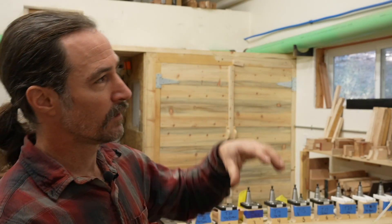It's a lot quieter in my shop now. Even if I get a cyclone dust collector in the future, I'll probably still use a closet because it will just make it quieter. For the test of whether it's actually reducing more dust, I won't know for a while — I need to use the shop and see if I get a lot of dust buildup everywhere. I'll clean up all the dust and report back later. I do some cuts without any dust collection, particularly on the CNC machine for deep carvings, and it produces a lot of fine dust that I don't have a good way to collect, so I'll still have to wear a dust mask for certain operations. But this should be a huge improvement.